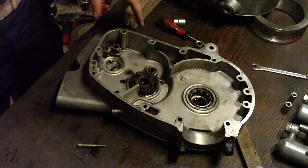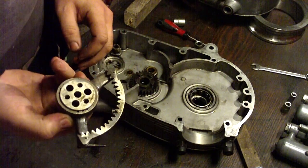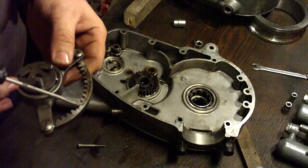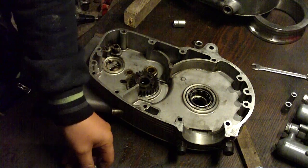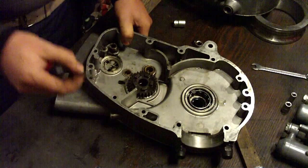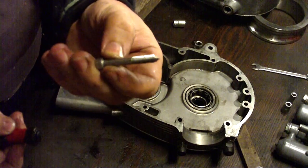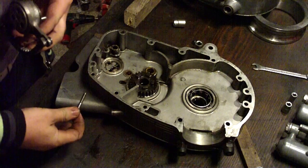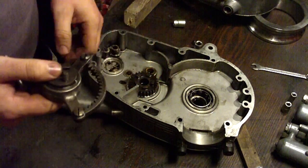In this video I will assemble a gear shift mechanism. On this part you have a number zero stem. This tooth needs to be lined up with this hole, so this tooth needs to be in the middle. To accomplish that we need to have a standard six millimeter bolt with a spearhead. This bolt, once installed into this housing, will block this mechanism from moving after we line up this zero with this hole.